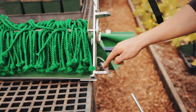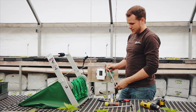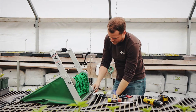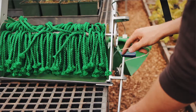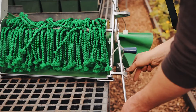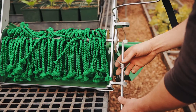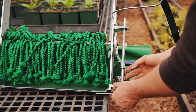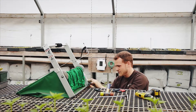You can go ahead and pull the pulley off and it comes right out the bottom. To put it back in — basically the reverse — you put it through the bottom bearing, making sure your belt is looped around the drive shaft, or else you won't be able to connect that back up. Then put the drive pulley with the groove facing down and push it up through the top bearing, making sure it's fully seated up against the bearing.